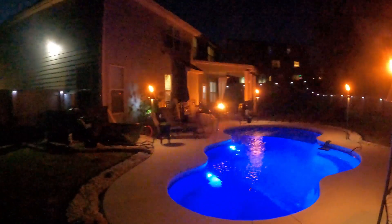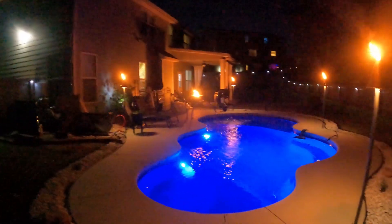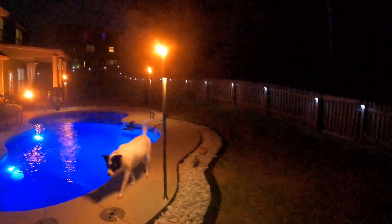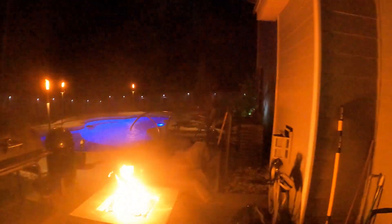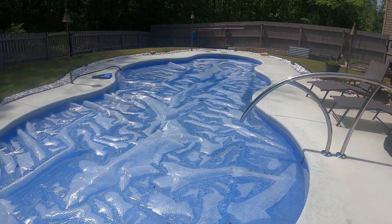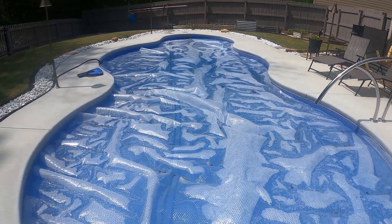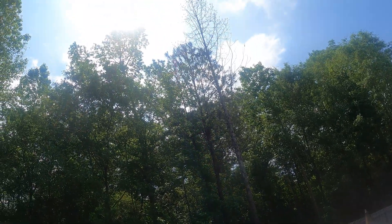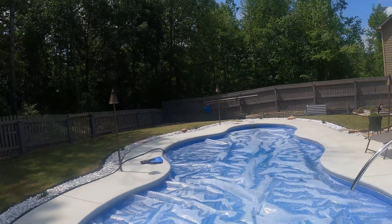It's going to take a couple of days. Another thing is you need good nighttime temperatures for this to work. If you have daytime temperatures as high as 80–90 degrees but nighttime temperatures in the 50s, it's not going to work properly. The last thing is it's really beneficial to have some type of cover — preferably a solar pool cover — to maintain that heat when temperatures drop at night. The solar cover also works in the daytime, magnifying the rays to warm up the temperature a bit faster.